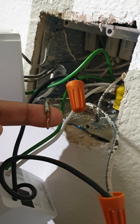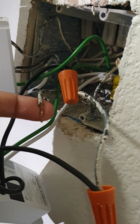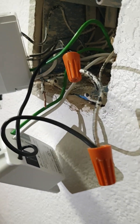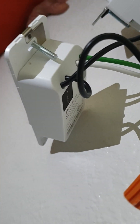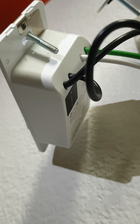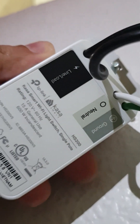I was trying to figure out where I should connect this wire so that it can get the hot. The hot, also called the line, carries the actual current. Looking at these connections, I was trying to decide which of these is the hot so I can connect to it. Usually the hot is black, but don't rely on that — sometimes electricians wire it so that black is not the hot, so don't be fooled by that.